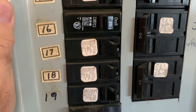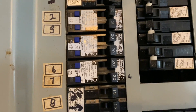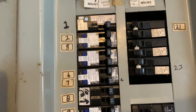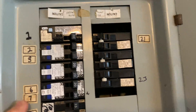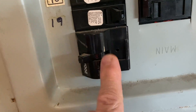It's not going to run all these at one time, but it will, for instance, run your washing machine individually. I wouldn't run the washer and have everything else running — coffee maker, all that stuff. Walk into a room, turn the light on; when you walk out, turn the light off. Don't try to overload your generator — that little generator is not going to handle all those at one time. But most definitely turn the main breaker off.